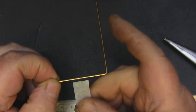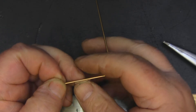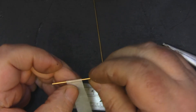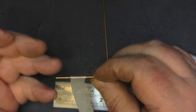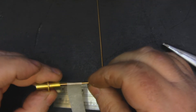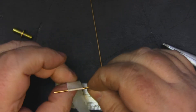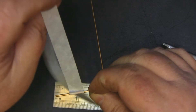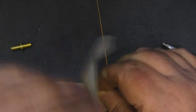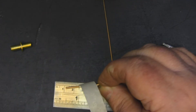I'm going to take a strip of masking tape — when I was prototyping I used aluminium foil, but there's really no need. You just want some packing to hold the tube center to the wire and hold it in place before you solder the ends up. Masking tape is fine and a lot easier than aluminium foil. Just aim for the middle and wrap it around a few times to build it up.